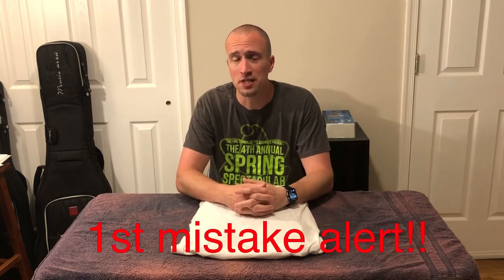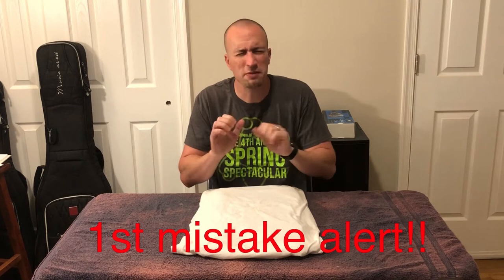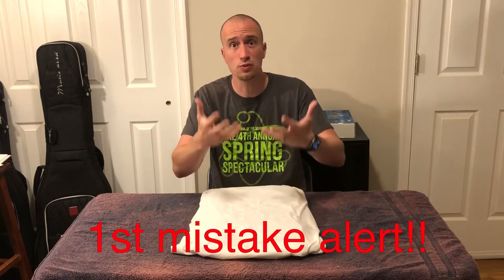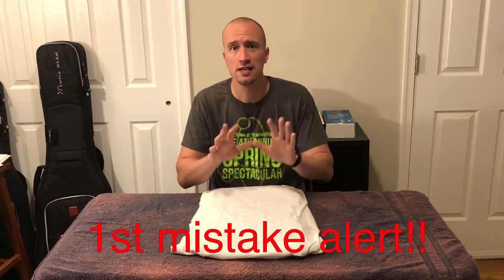The reason for that gap is I made a very big mistake in the preparation and painting — a huge blunder. I want to be fully upfront and use this as a teaching moment so you can avoid making the same mistake. Here is the lesson: if you're going to paint a guitar with some kind of color coat — and I'm not talking about a stain where you want the wood to show through — if you want to cover the guitar with color, you have to use grain filler. You just have to use a grain filler.